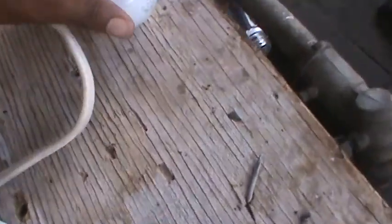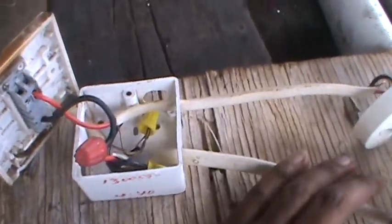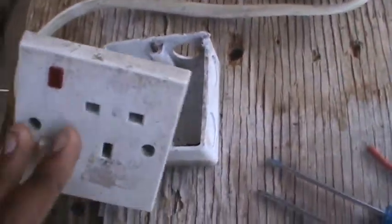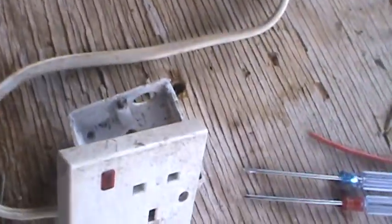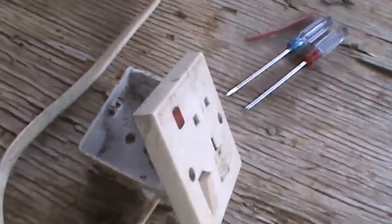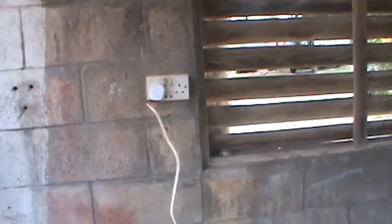I just finished a small circuit. This is a single-way lighting circuit with a supply outlet. I just did this so future electricians can see how you wire a light with an outlet — power coming from the light box. As you can see, I came down and have my switch right there, and it goes back to the receptacle right there.